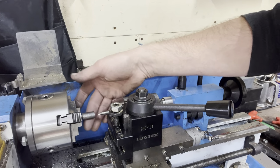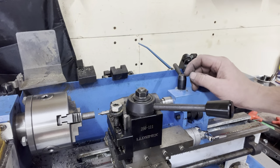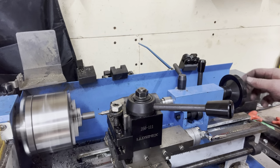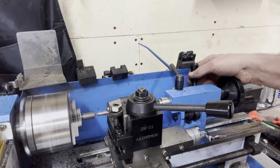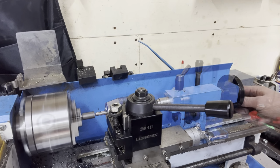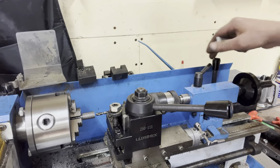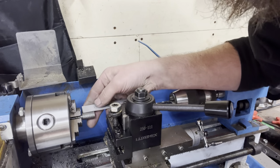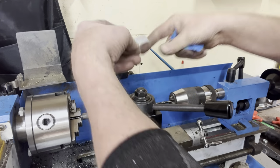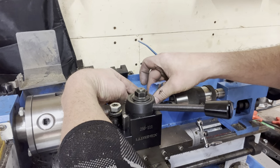Okay, so I cut off the waste on the bandsaw. I'm going to give this a quick spot drill, and then I am going to drill it out to 7/32 to accept the shank of the blade, and then we'll clean up the outside and we should be good to go with this part. Gonna add a little bit of tape to the drill bit and just make sure we don't go too deep. So we've got 7/8 there. Let's drill this to 3/4 total.